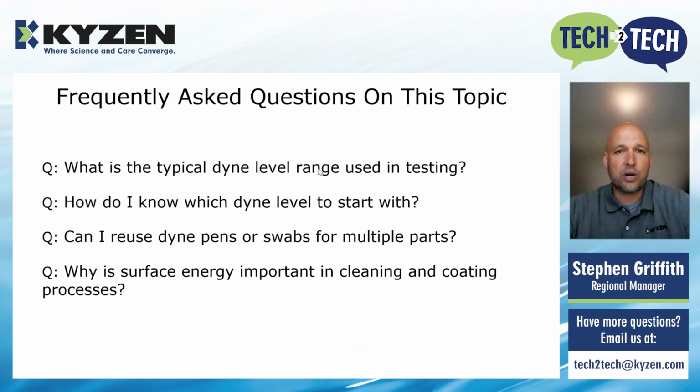So, a few frequently asked questions that we have on the topic. What's a typical Dyne level range used in testing? Dyne testing usually covers surface energy ranges from 30 to 72 dynes per centimeter. It's said that for most industrial applications, for proper adhesion, anything above 38 dynes is considered acceptable, but in some high precision cleaning applications, at least 50 plus dynes is required for them to pass or fail.